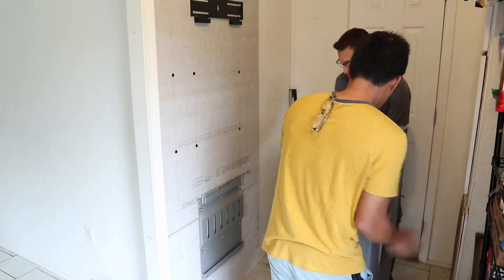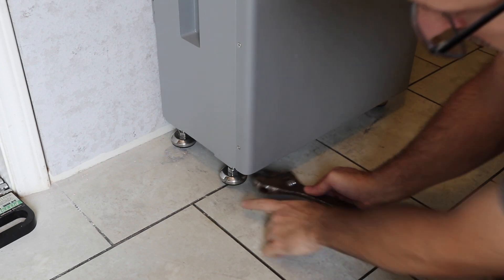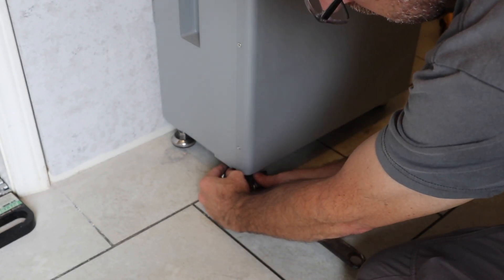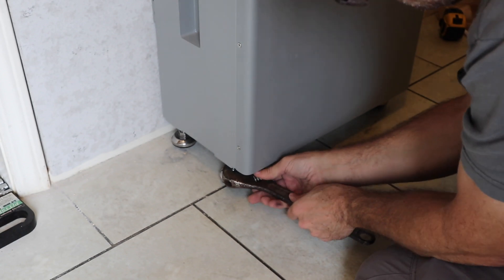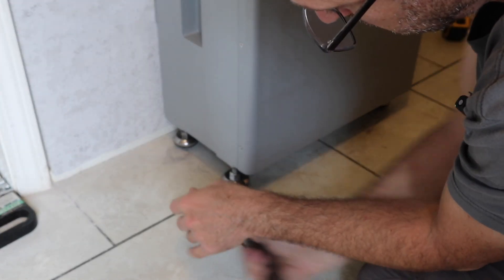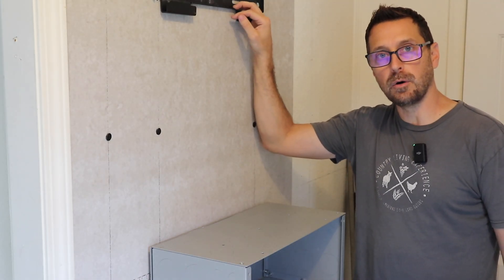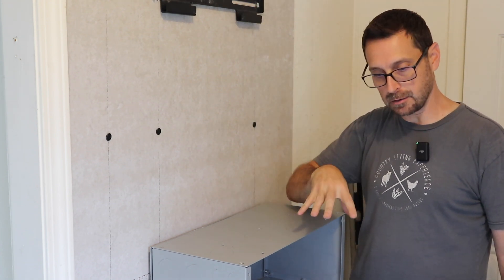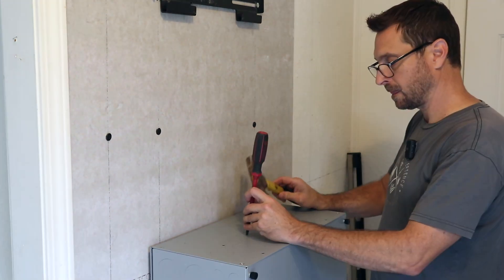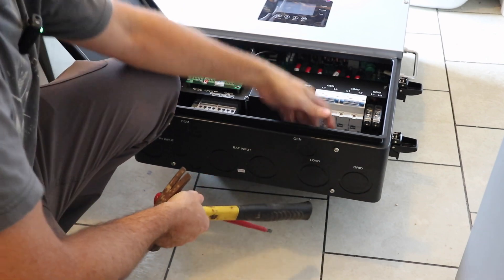Okay, let's start hanging this stuff on the wall. You can see my feet are just a little bit above the ground, maybe three-eighths of an inch. I'm just going to use an adjustable wrench, unscrew these, and just get them down to get that weight on the floor below. Then I'll tighten it against the floor a little bit just to get that weight distributed properly. Before you hang your 18k or 12k on the wall you need to look at your conduit box and the bottom of your inverter and remove the proper knockouts.